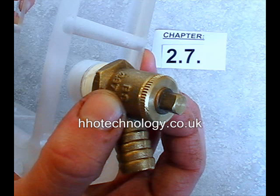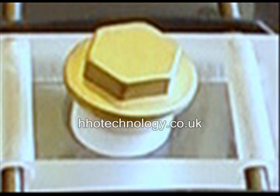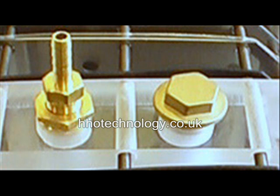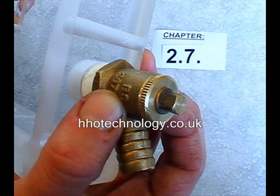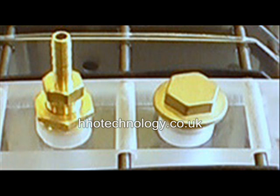The default set-up with the supplied brass fittings: fit one stop plug to the reservoir bottom hole and another to one of the two top holes. This top hole is really for a flash port, which you should install for safe operation. Fit the drain cock to the side hole and the half-inch to quarter-inch reducer with a quarter-inch barb fitting to the other top hole.